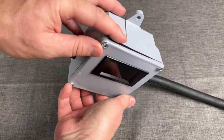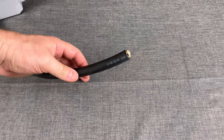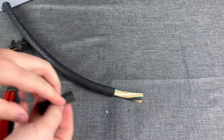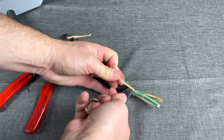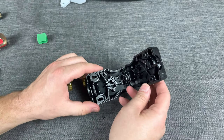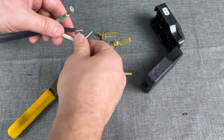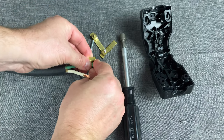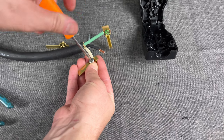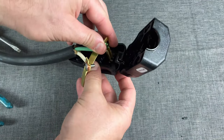That's pretty much your finished box. On this side I'm going to write 'load' so I don't forget which receptacle goes where. Go ahead and strip the end of the 10/3 wire — you just score the outer sheath and twist it off. The receptacle I'm using is a 30 amp RV trailer plug type; I got everything at Home Depot. Strip all three ends. Wiring this is actually really easy because the ground is a unique plug that only goes in one place, and the spot marked 'WH' is for the white neutral wire on the silver tab — and the black one only has one other place to go, so it's a process of elimination.